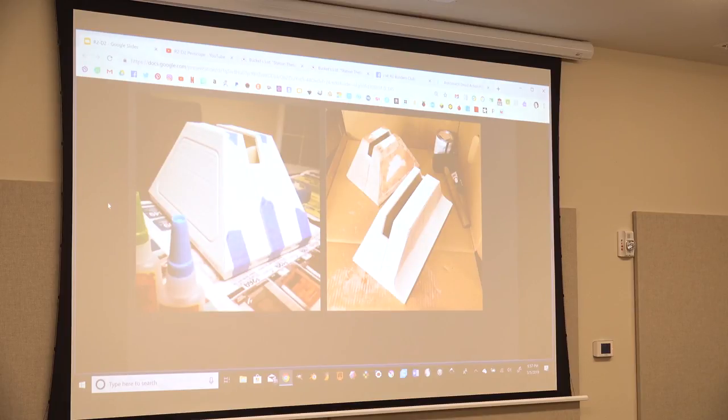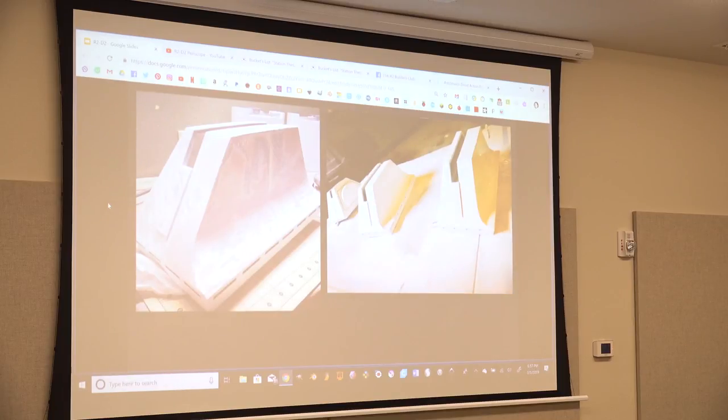These are the foot shells. I got them priced for a local manufacturer to 3D print them for me in one solid piece. These are one of the pieces that are too big to print on our machine. And they quoted me $1,000 a piece for each foot. And I didn't respond, but I printed them in several flat pieces, and then they warped, and so there's tons of Bondo on them, and I just worked the material. Look at the one on the left. There's Bondo, there's filler primer on it, there's sanding. I think that's a beautiful shot. It's all marbleized. And once you load them up with several coats of paint, it doesn't look so bad.